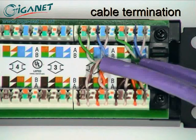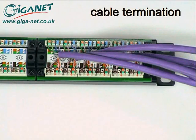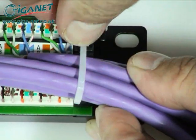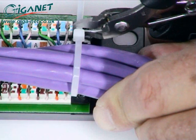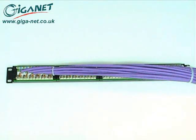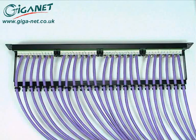Repeat the process for all the other cables on the panel. Tie each bundle of six cables to its appropriate anchoring point using the supplied cable ties, then strap the bundles together for a tidy appearance. As an alternative to dressing all the cables from one end of the panel, the cable bundles can be divided in two and brought to the back of the panel from both ends. Another option is to attach the rear cable manager and use it to dress the cables directly from behind the panel.